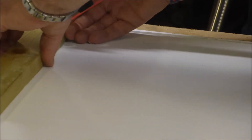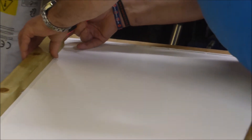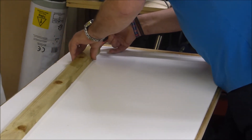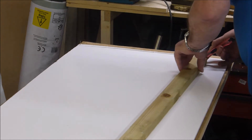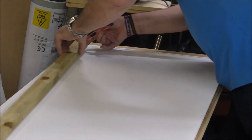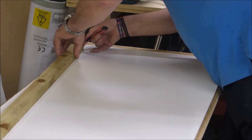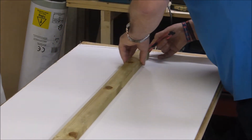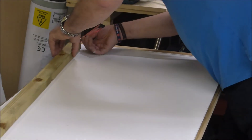So it's the next pass — just give the second score and by the time it's cut through we'll complete the first gauge. The advantage to doing it this way is that we ended up with two radius measurements out of one gauge. The outermost line — the first one we drew — will be the ten foot line, and if you use the inside of that it's two inches less, so each gauge will give you two separate radii.